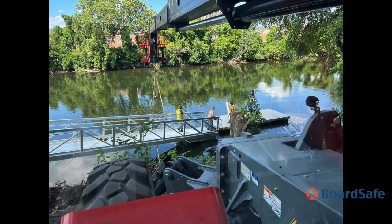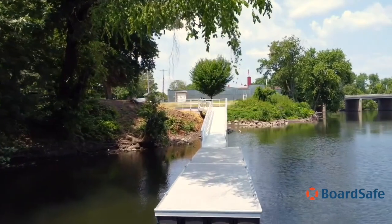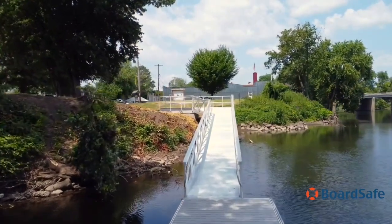The gangway was then connected to the side of the deck and ran parallel to the riverbank. Supplemental flotation was placed at the bottom of the gangway to provide adequate buoyancy for its weight, to maintain a freeboard of 16 inches — the same as a floating dock.